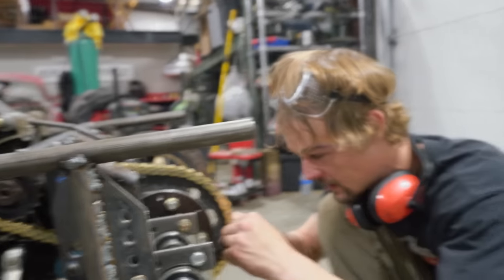I just got through mounting the fuel pressure regulator — I made a bracket right here, kind of put it out of the way but where we can see the fuel pressure. We're going to make a scoop that's going to come off the tire, a little scoop for our oil cooler, and the scoop will help shield the pressure gauge from any rocks that the tire kicks up.